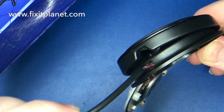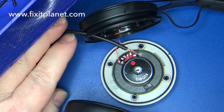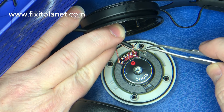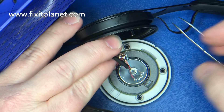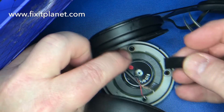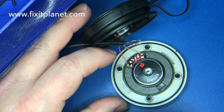There's our little hole — we're going to slide those wires through it and leave it loose while we work so we can move it around. We'll get the wires positioned where we want them and move the two wires we don't need out of the way — bend them backwards. That's the blue and the striped red-and-copper one. We'll use basic electrical tape to tape them back out of the way so they're not touching anything.